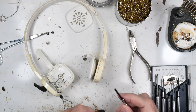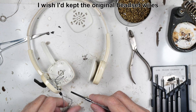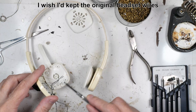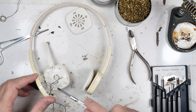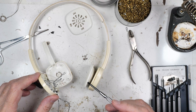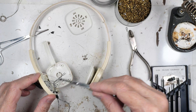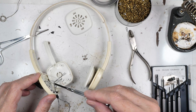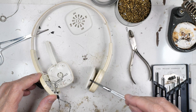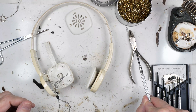I've already got it underway. I've got this side opened up, and what I'm going to do is I put another set of wires in here. I've got a second set down here, and I'm just going to solder these two together on this side. There's already a wire that runs over here, so this is just connecting the new wire that's incoming, the pair, to the pair that's already there that goes all the way around. Then I'll solder the element on this side.